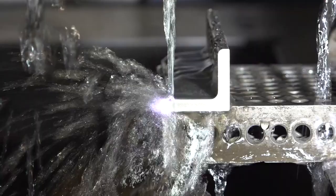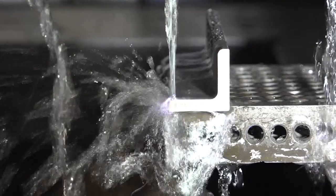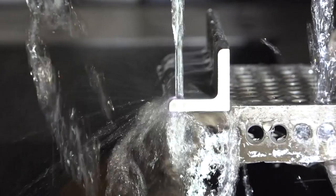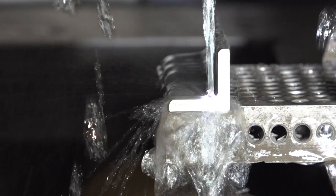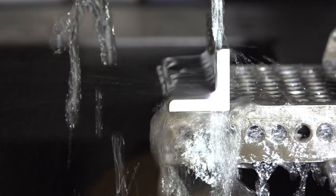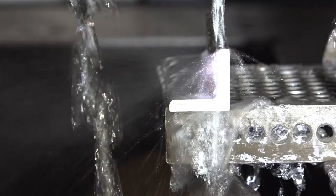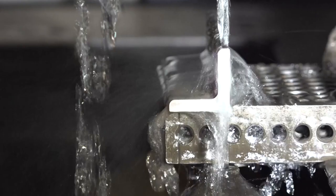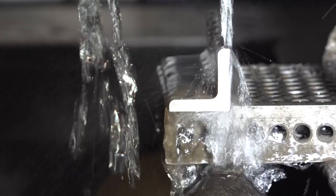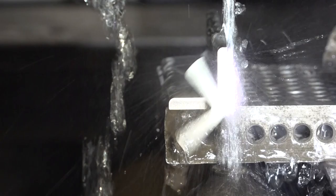Now, this aluminum, which is non-magnetic, is being EDM'd. We will slow the cut as it EDMs the upright angle. We will speed up the cut again. We will slow the cut as the part pulls off.